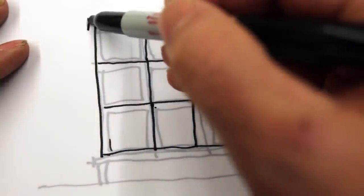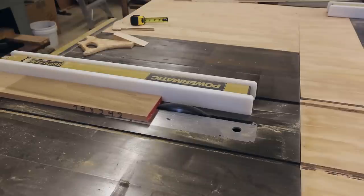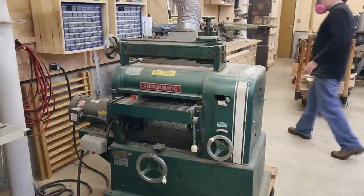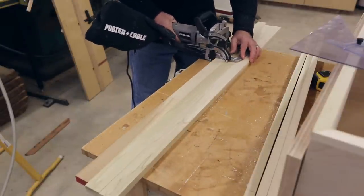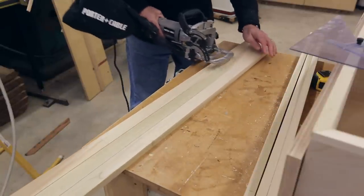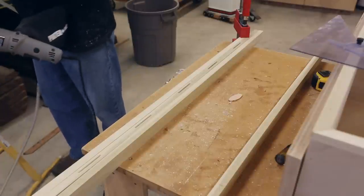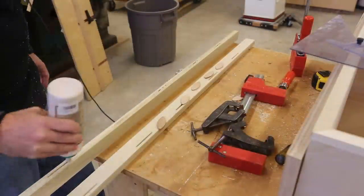Now I'll make the top cap. The main function is to cover the exposed ends of the plywood sides on the top. The bottom doesn't matter so much. I'm going to make a cap piece that sits on top — an L-shaped frame with a piece of plywood in the middle. To put the L together I'll use biscuit joints. The key with getting biscuits to work is to make sure you don't have any stray sawdust on top of your piece of wood as you put the biscuit joiner in, because it will raise the height of the slot and your pieces of wood won't align correctly.